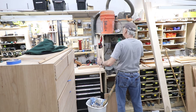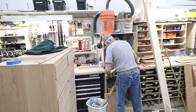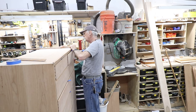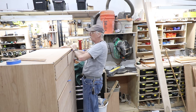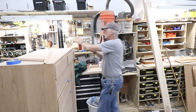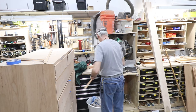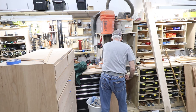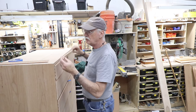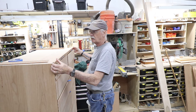So we just mark the back of this. The new pencil I got for Christmas from Mara — my wonderful pencil. Mark that beyond the end; I can cut that off with a hand saw later. There are my three pieces of the crown molding. Now what I need to do is just nick off this corner here a bit to give it more of a finished look, and then we can fasten these things in place.